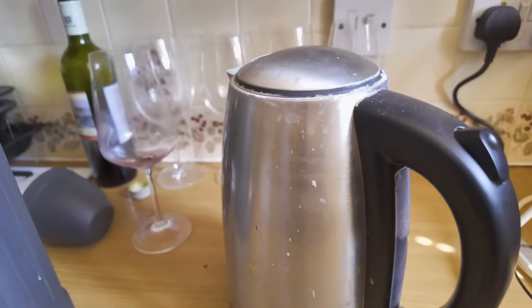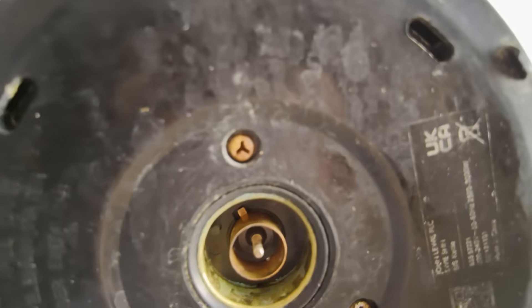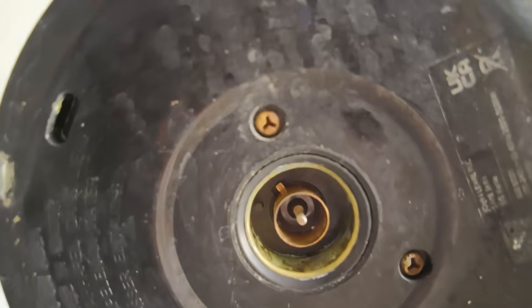Let's have a look at the bottom of the kettle - there's a bit of something going on there. It could be a small leak in the bottom of the kettle that's causing the problem. I'm just trying to see if it's just residual moisture. Switch it on here... that's it, it's definitely the kettle - definitely in that switch.